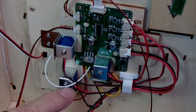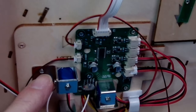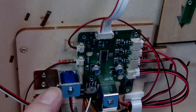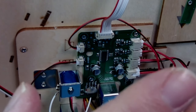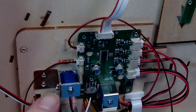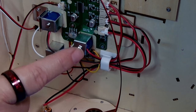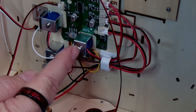The coil underneath is wrapped with blue tape to help protect it. On the one that worked, the screw isn't going all the way into the coil. On the other two, I had to go in and back that top screw out. The bottom screw seems to be okay because it has the wire connector underneath it, which keeps the screw from going in as far. So you need to take that top screw out and put a small washer behind it. Justin just backed his out a little bit and left it, which is fine if it's still sturdy. I took mine all the way out, put a small washer behind it — if you build a lot of these models you'll have tiny little washers — put them back in, and voilà, they all work perfectly. If your pop bumpers aren't working, it's because these screws are too long, going all the way through the blue tape and grounding out on the coil.